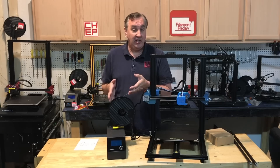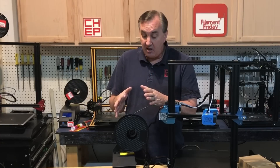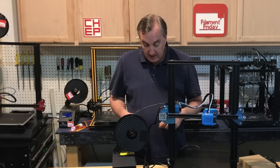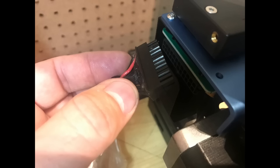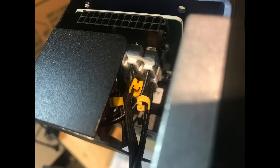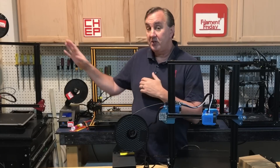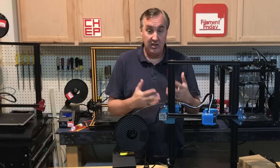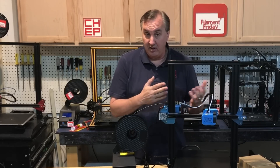The standard LCD makes this actually easier to upgrade or hack if you're into that. The wiring comes down to two cables and one main cable for the hot end, connecting to a large connector at the top, then a breakout board, and another at the bottom. It's similar to the CR-10S Pro — it makes assembly easier with fewer connections going to the machine, though there are actually more connections because of the breakout board.